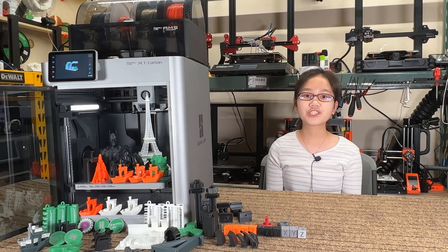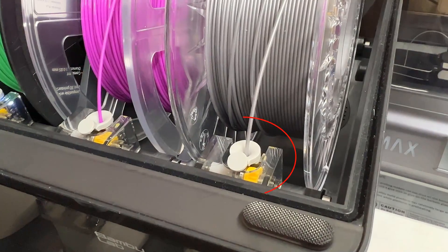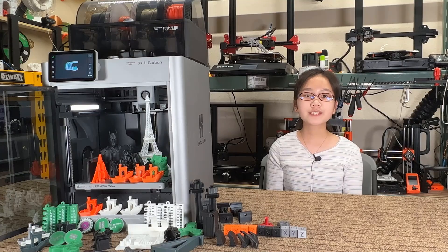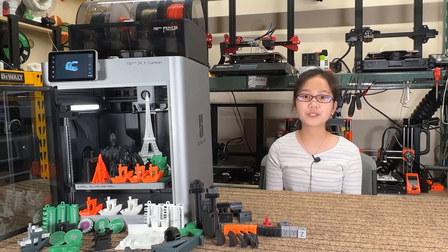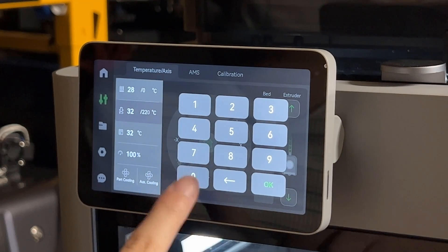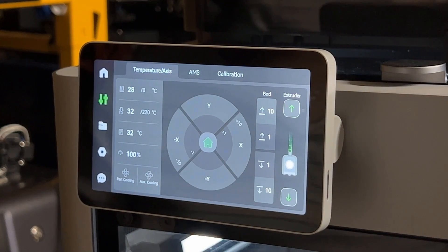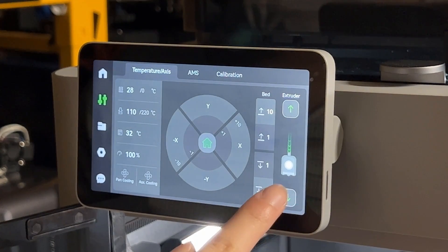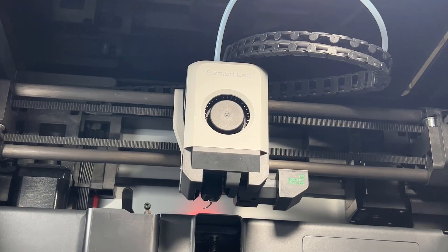Third, when the AMS is jammed, the red light will be on, but it won't send a notification to the phone app or slicer monitor, so you have to sit near the printer and fix it, or you end up seeing nothing is printed and the red light is on. Fourth, if you are not purchasing with the AMS and just use one roll of filament like a regular 3D printer, you have to heat up the nozzle manually and move the extruder motor using these arrows. You can still move the extruder even if the nozzle is not heated up — in this case the motor is just skipping. Cold extrusion should not be allowed.